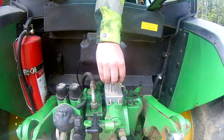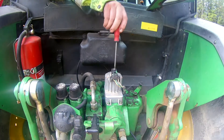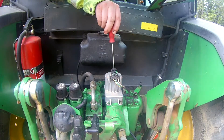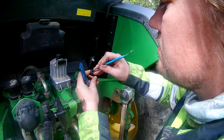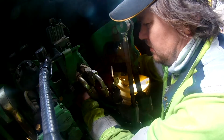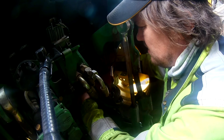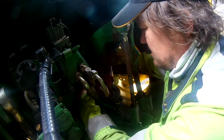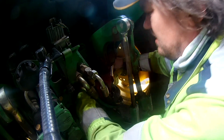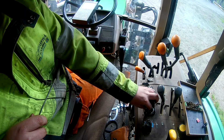I did notice that it started moving when I wiggled the contact around. I was on my way to start doing a bridge connection to measure back there, but I ended up forcing it too high and blew a hydraulic hose. I bent out the little blades in the connector — it had probably been on and off so many times — to get a better connection. Had to change and get that hose out and replace it, which was quite tight in the machine with all the hoses.